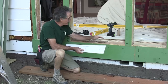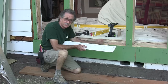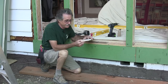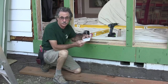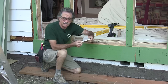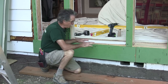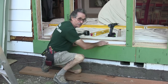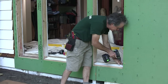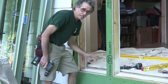The next step is installing the sill pan. But before I put the sill pan in, I want to put in a cant strip so that any moisture that gets inside this opening will be directed outside. This is the cant strip I'm using — I made it out of Versatex PVC trim so it'll never rot. The cant strip is really nothing more than a piece of material ripped from a half inch to about a quarter or an eighth of an inch, giving us some slope. I'm going to put a cant strip into each one of these openings and screw them down, and then I'm going to put a membrane sill pan in here next.